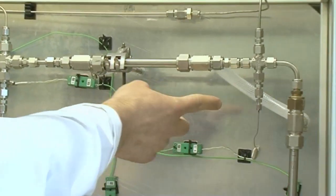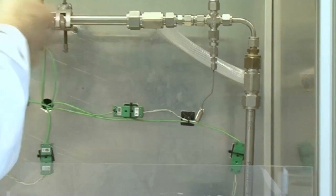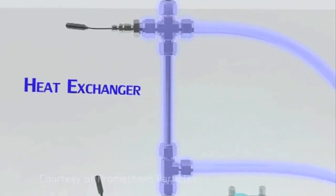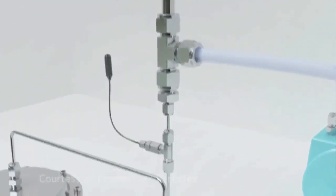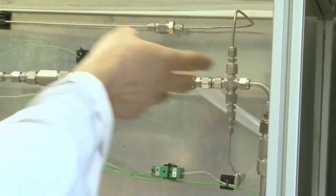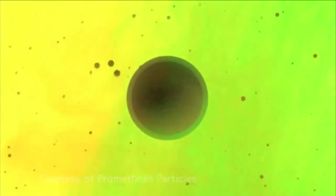This is a cooling system — at the back you've got those transparent tubes with water flowing through them. You have a tube with a hot fluid and an outer tube with a cold fluid flowing against it to cool it down, so it's a lot cooler by the time it gets to that stage. At this point we can inject in organic material which can coat the outside of the particles and make them useful for sun creams or whatever we're doing with them, or printable inks.